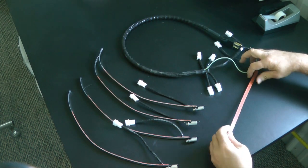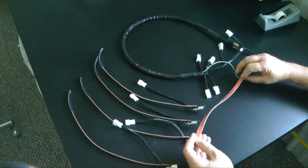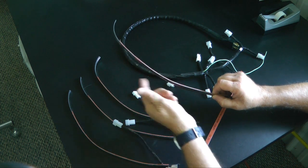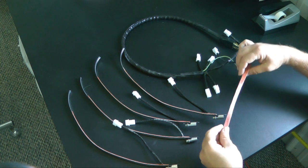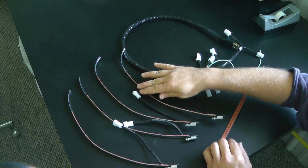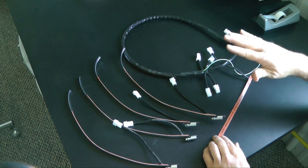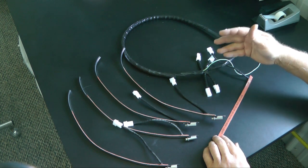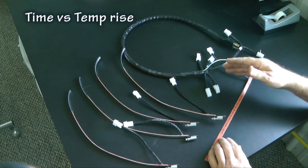There are one or optionally two strips that attach to your oil sump. For the Rotax 912, instead of a strip, there is a large band that goes around the oil tank. The idea is to distribute heat to warm the oil and each of the cylinders. These are 50 watts apiece, so we're looking at 250 watts for this system. This will raise the temperature of the engine, and you can experiment to see how long it takes to raise how many degrees, so you'll know how soon to turn it on before you want to go flying.